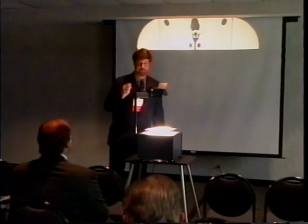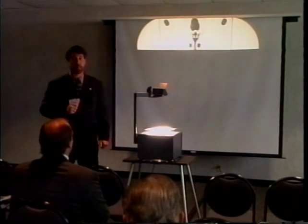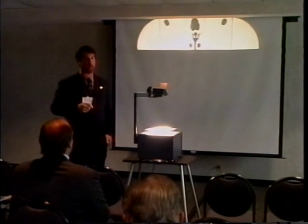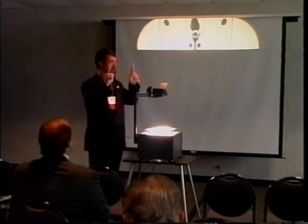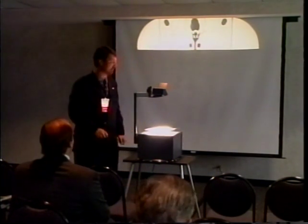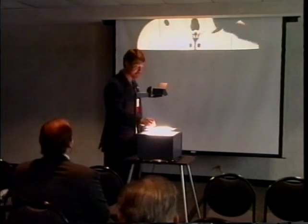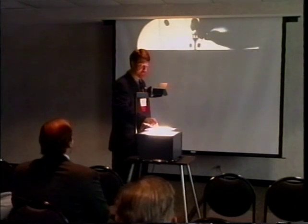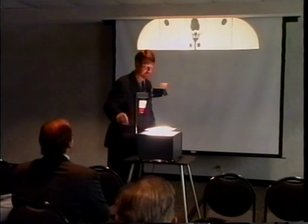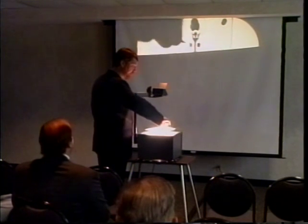So if you have movable banking pins, which drives me nuts whenever I worked on a pocket watch, you always could tell that one banking pin was turned out more than the other, or you had just the lone pin sticking up and one's bent out more than the other, drove me crazy. You knew you were in trouble when you saw that situation. But if you have the movable banking pins, you want to move your banking pins in to the center, as close as they can be.